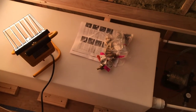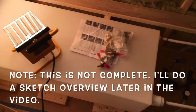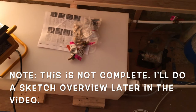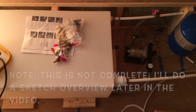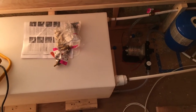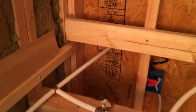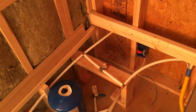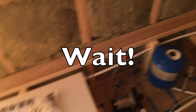I'd like to do a walkthrough of the water system in this tiny house. This is the specific setup for this house, but it could be mimicked for other tiny houses. Plumbing very simply starts right there through the wall — that is the fill point for the system. So you hook a garden hose up to it and that's what gets water into this tank. This is a good point to show you where and what that looks like on the outside.